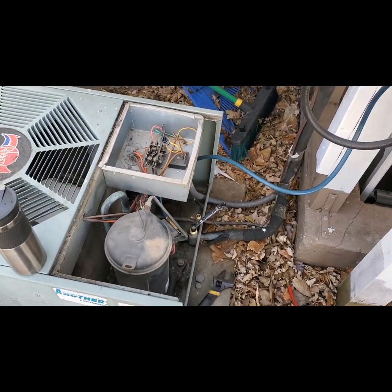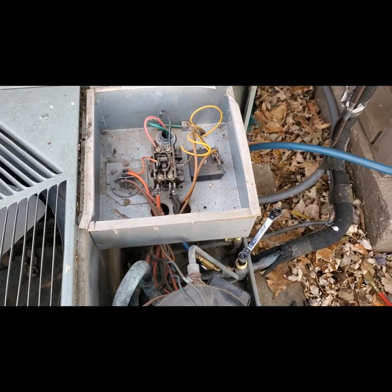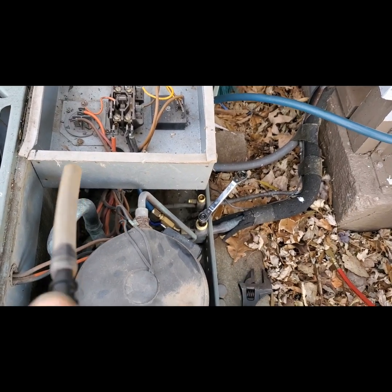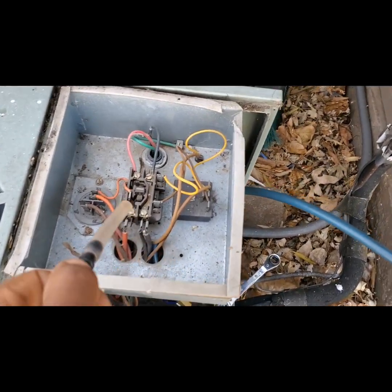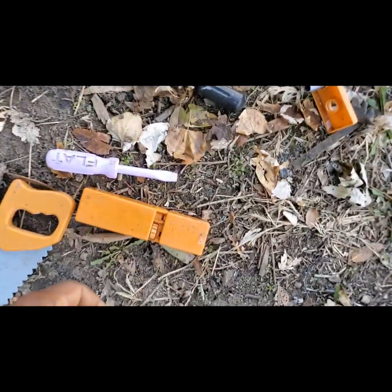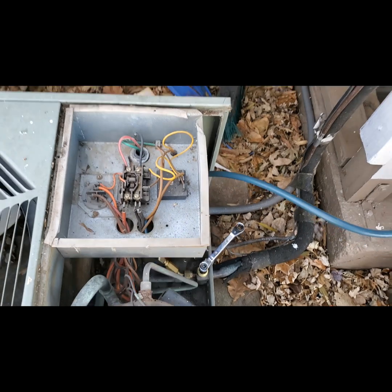Keep all the R22 in there. So we're starting to pump down. For this part I always get something non-conductive, because what I'm going to do — you can turn on the thermostat to cooling and the compressor will kick on. As long as there's nothing to shut it down it'll pump down. But then you've got to turn off the thermostat, or pull some electrical wire, or pull the disconnect — while you're not close to the compressor while it's still running. You don't want to blow the compressor. So I use something that just refuses to let electrons pass through it, like an insulated screwdriver, a stick, or one of your kids' fake play screwdrivers. Since I'm an HVAC mechanic I happen to have this for my manometer, so I'm just going to use this.